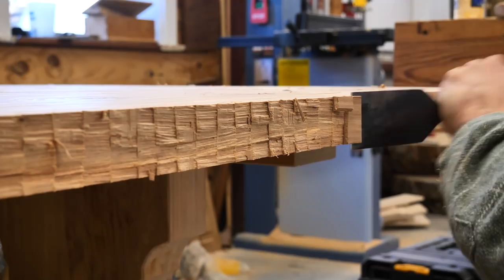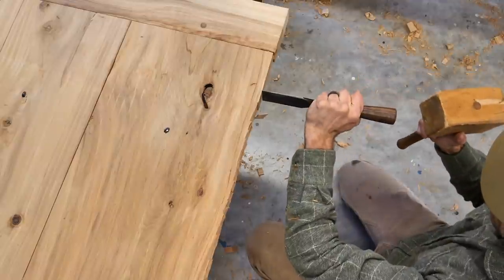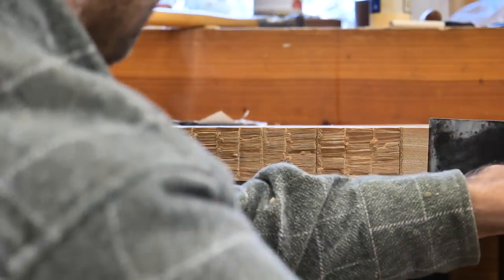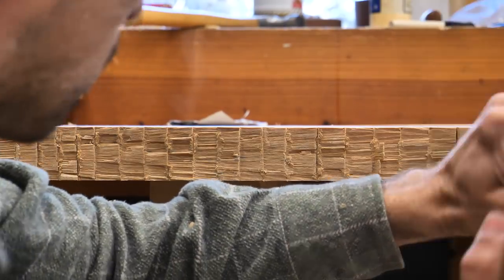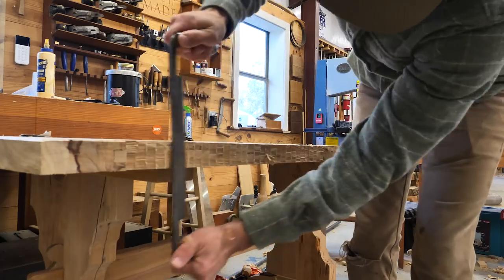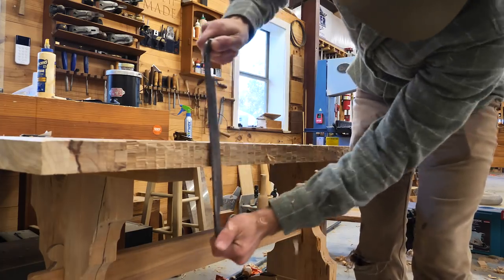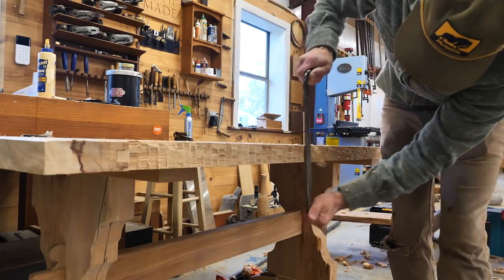You can also see, looking down on it, how it kind of follows the shape of the grain — so it gives a little bit of organic feel to the edge of that board. It's not perfectly straight. As you split these out, they're kind of going with the grain, obviously, because you're splitting it. When I just ended it right there at that breadboard and popped it out. It's pretty rough now, so I decided to come back with a draw knife, just try to split off any loose fibers, kind of clean it down a little bit, just leave those chisel cuts.